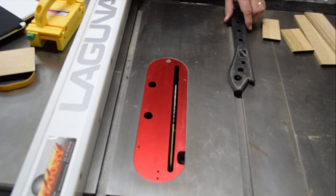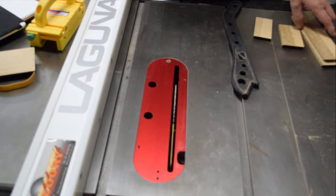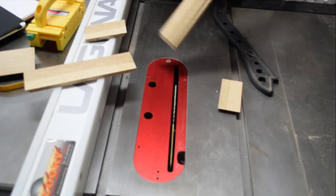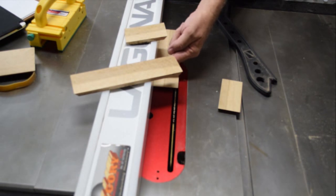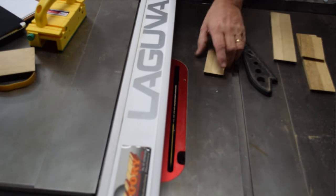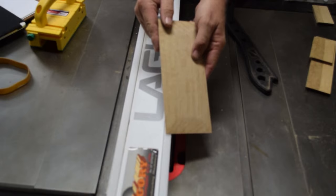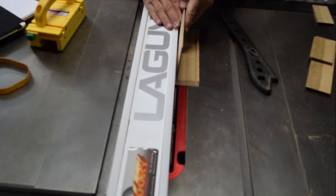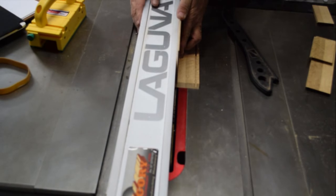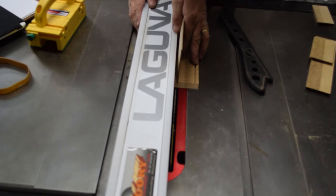As I've said before in several videos, I always have the blade furthest away from the fence when I'm cutting slots. However there are always exceptions to the rule and this happens to be one of them, because I've got four pieces to cut and one piece is narrower. So if I set the fence up to cut my slots at a certain distance from the fence, when I come to this little narrow bit it's not going to work. So in this particular instance — I don't like doing it, but I will — I'm setting the blade up closer to the fence. To get the depth I get the bottom that I've made, hold it up against the fence, and I don't want the bottom to be touching the fence because that's going to be too close to the base. So I set it up, have a look, and then move it a little bit further out and we'll see how that looks. And that's nice.